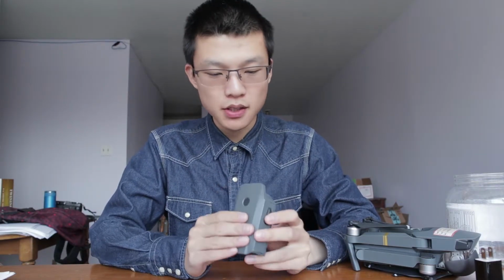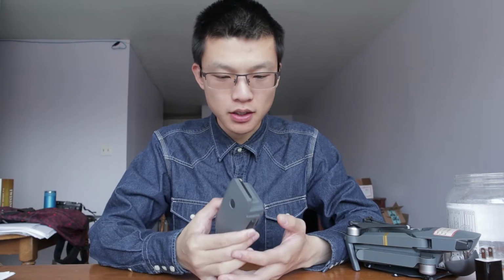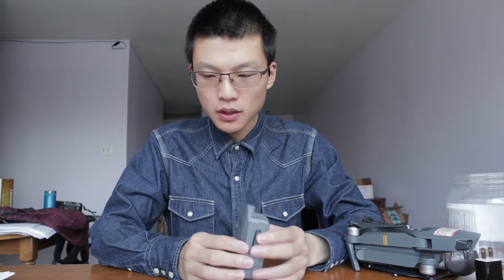The second reason probably is because the battery itself will have a natural tendency to warm itself up during excessive discharge because of a high current flow. This can be observed in summer when the battery's temperature is around 27 degrees Celsius, and when flying it keeps warming itself up. Now, based on this, we can take a look at the battery management system.